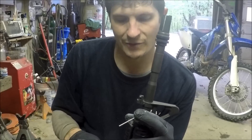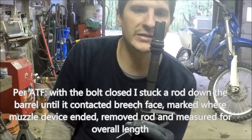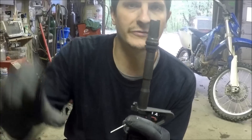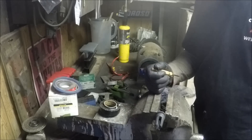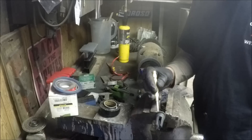I've already gone ahead and measured from the breech face all the way to the tip of this flash hider and it is over 16 inches. So let me get this chucked up in the vise. I have the flash hider chucked up here in the vise and I made sure not to tighten it on the ratcheting teeth so it won't mess up the interface between the suppressor.